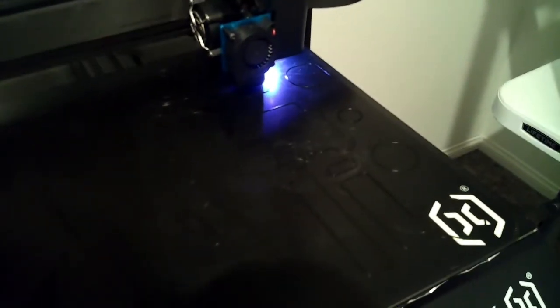We are on our way to making the first dagger. It's going really slow so I can lay down a pretty decent first layer — I put the first layer settings at about 25% of the entire speed after replacing this motor, and it has been going good ever since. We are not even at a percent yet. There was a little adhesion issue right here but I'm just going to leave that alone and let it finish up. The rest of this looks pretty cool — the dagger blades look like they just finished up. Everything looks like it's going according to plan, but we're not even at the 50% halfway mark so we still have a lot to go.